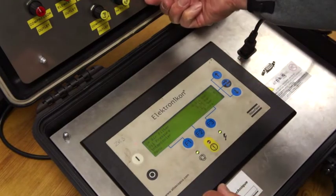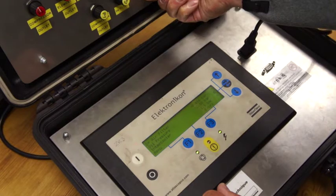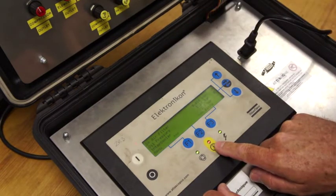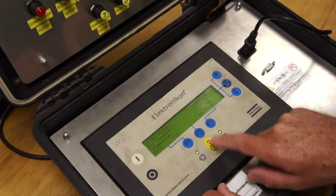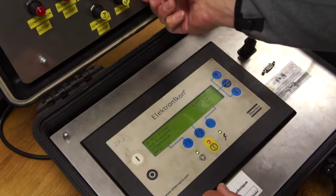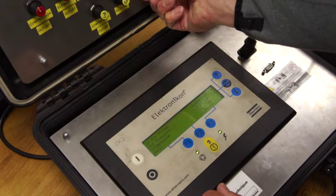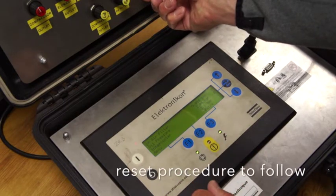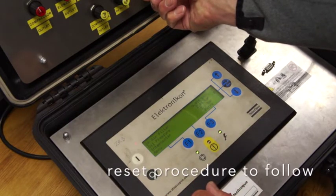Now what I'm going to do is turn the oil pressure down. And now you can see it's actually tripped — the red light comes on and you get the flashing asterisks. I'm going to take that oil pressure back up so when we start it back up it's okay. You can see now as the oil pressure's come back up the trip light has gone off, but that should have been a reset to be fair.